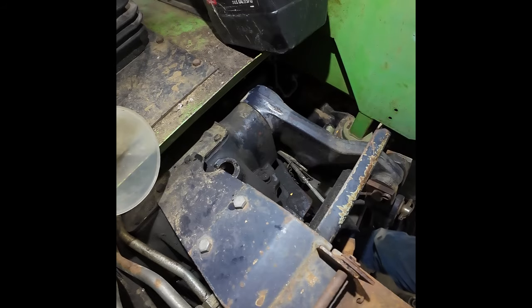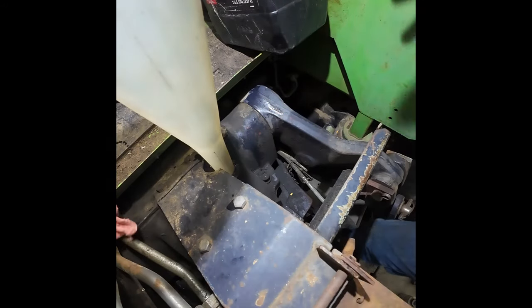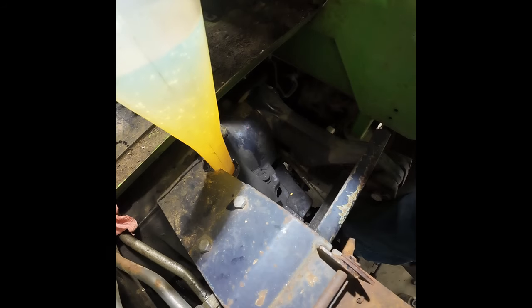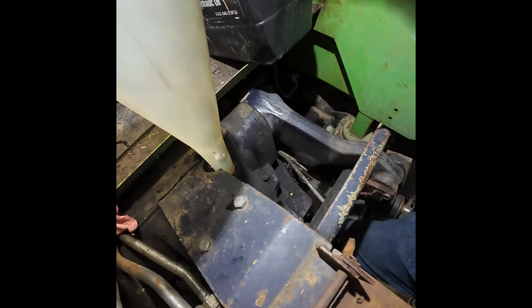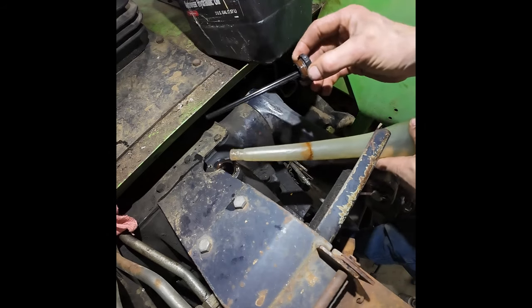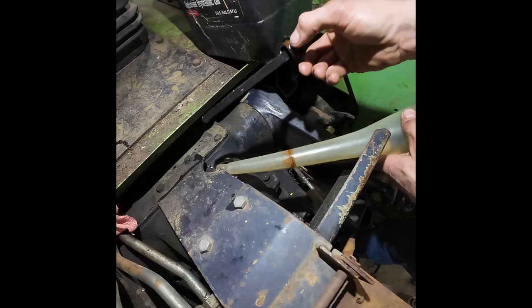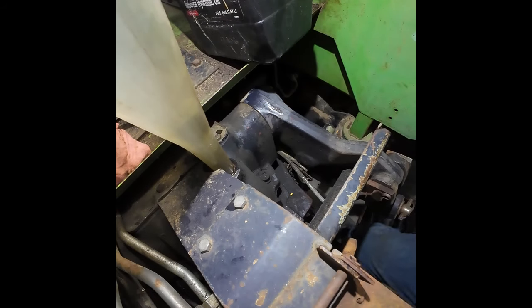Getting on the stick now — we're going to put it to the full mark just until I finish the brakes and get this thing running. I will do the brakes next because I haven't filled that cylinder yet — I'll just use it a little bit. Let this drain in there for a minute. That looks good for now, so I will finish up this hydraulic fluid topping off, bend that one cotter pin, and then I'm going to bring you back for the brakes.